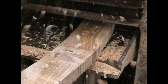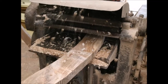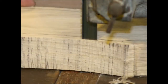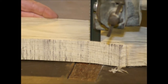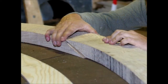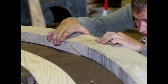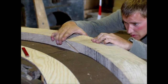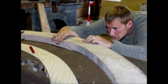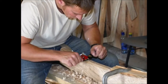Now the real work begins. We start with the oak stem and identical stern post. These are roughly cut on the bandsaw. The stem and stern post are made out of 2 pieces of oak, glued together and strengthened with copper rivets. When the posts have been beveled and sanded, they will be joined to the keel. Good results are gained with good craftsmanship and the appropriate tools.